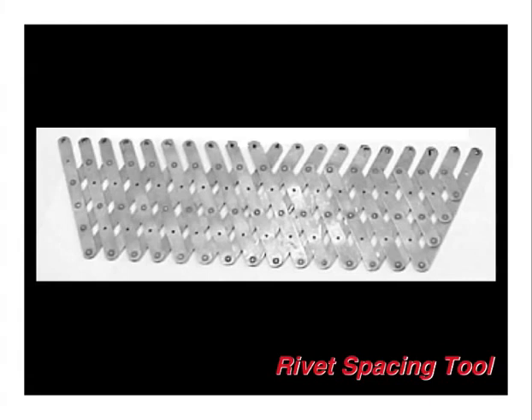This is a handy little tool I would consider to be more of a nice-to-have, and that's a rivet spacing tool. You grab both ends and pull it out, and it allows for an evenly spaced set of holes at the top. It's useful, for example, where in your plans you have seven holes evenly spaced and it only gives you one dimension. You simply put the first hole there, count seven over, and expand the rivet spacing tool to that seventh hole, and that will give you an even spacing. Again, nice to have, not absolutely necessary.